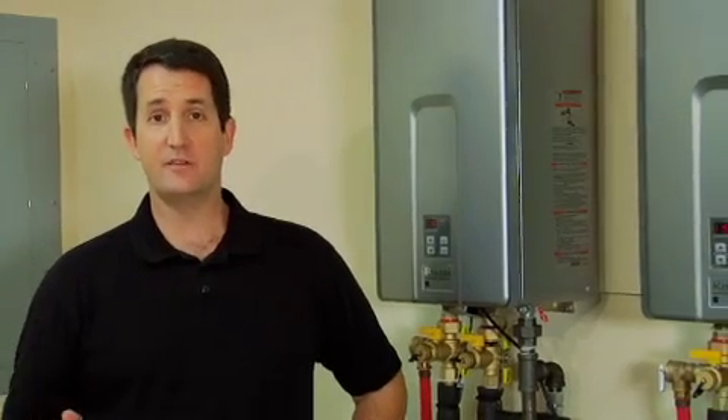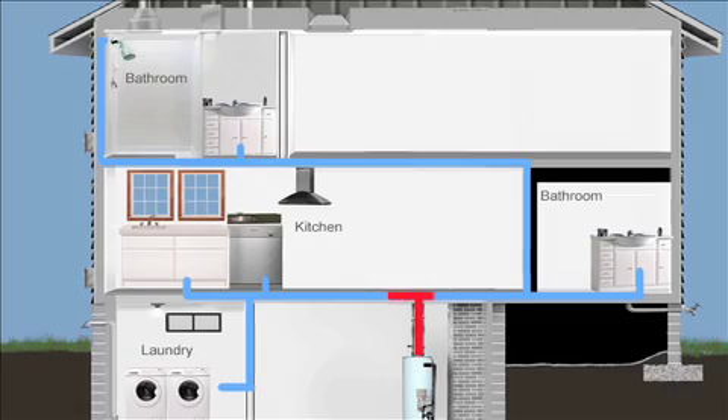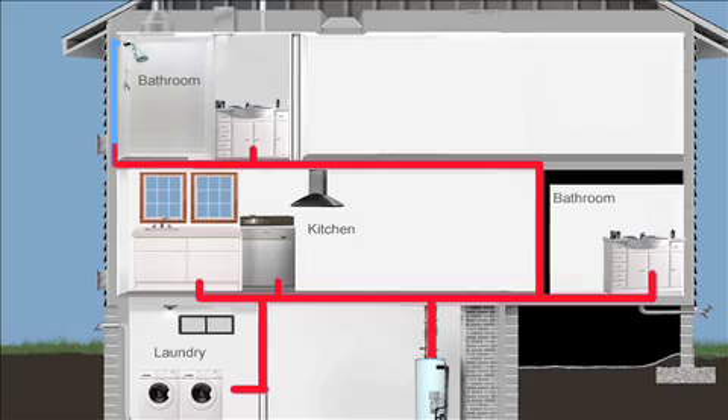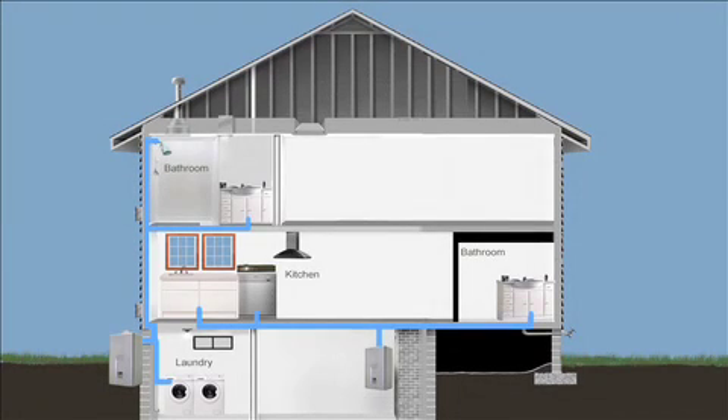How many controllers can one of those units carry? We recommend a maximum of four controllers per household. In existing homes like this one, the ability to zone multiple tankless water heaters — basically assign each one to an area of the house — requires an extensive and expensive remodel of the home's plumbing system. For new housing, however, you can plan for zoning and plumb the house accordingly as you build. For example, installing two tankless units — one in the basement and one on an outside wall — zoned to cut lag time could deliver a constant supply of hot water with energy and water savings benefits that tankless water heaters afford.